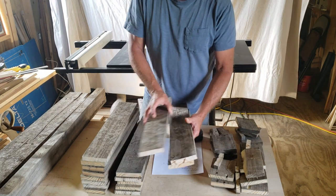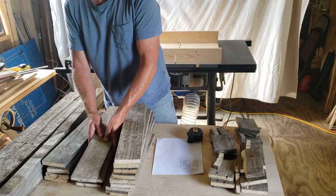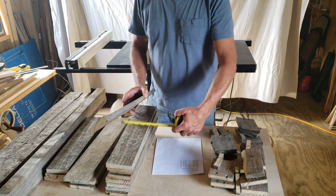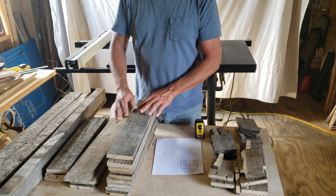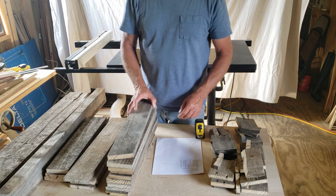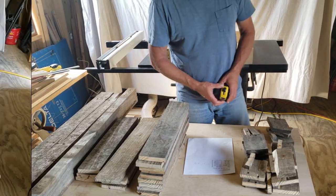1¾ by 14 — one, two, three, four — those four out of that one. And 1⅜ by 14 — two, three, four. So there are my long and my short legs, or the wood that I can use to make them. What I could do — it's 3¾ wide, 3⅝ — I may take one of these and get the 1¾ leg A and the 1⅜ leg B if I can get the right dimensions off of it. I am going to try and keep the outside with the saw marks — I think that'll just add a little to the rustic nature of it. I'll check back in when I get these cut and we'll move on to our cross boards.